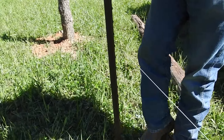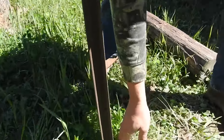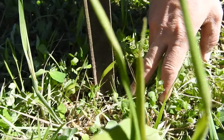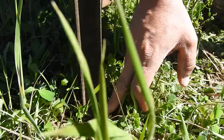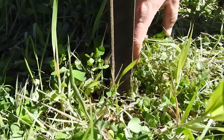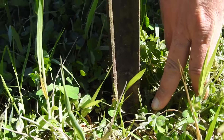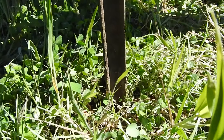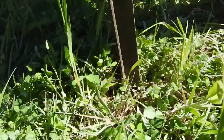And another thing is — if you can see the top of that plate — this side has a point, and as soon as that top edge point comes flush with the top of the ground, that's when you stop hitting the T-post. You'll see.